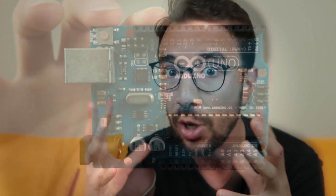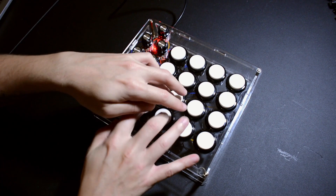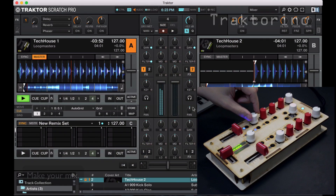The Arduino is a board that takes information from the physical world — things you can touch, feel, smell — and converts it into information that can be understood in the digital world. You can also manipulate that information and send it back to the physical world. The Arduino has inputs and outputs, and with a little bit of coding in a C-based language you can tell what those inputs and outputs will do. For example, you can connect a button as an input and code it so that every time you press it, it sends a MIDI note. Or connect a potentiometer and send a MIDI control change when you move it.